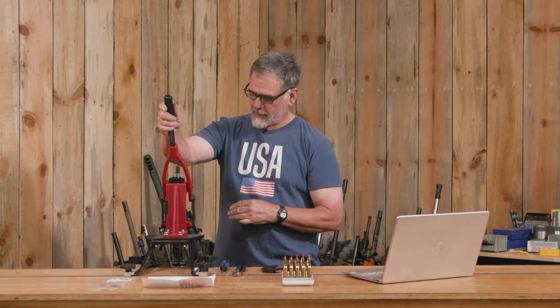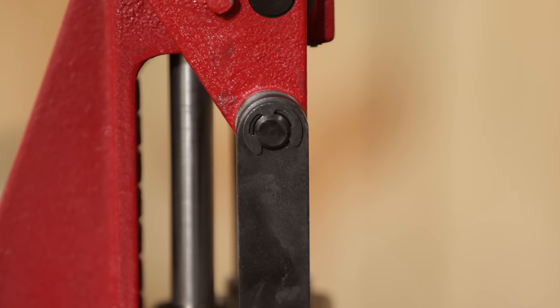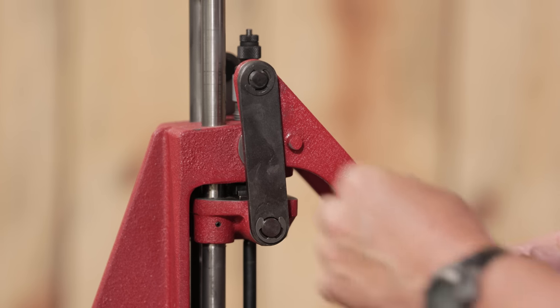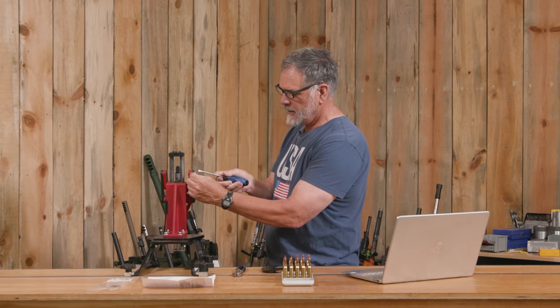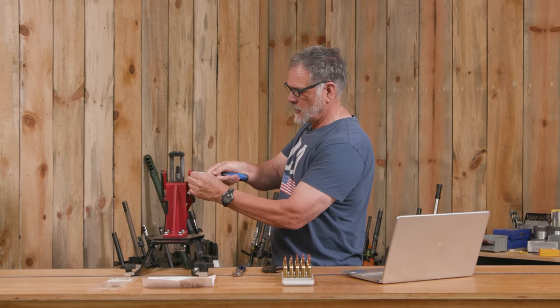So the first thing we have to do is remove these E-clips. I like to do that using a flat-bladed screwdriver. It's important to wear your safety glasses because these little clips can go bounding out of there in crazy directions all of a sudden — they're like spring-loaded. Put a thumb or a finger on it; that helps hold this thing in place so it doesn't go crazy on you and wind up halfway across the workspace.